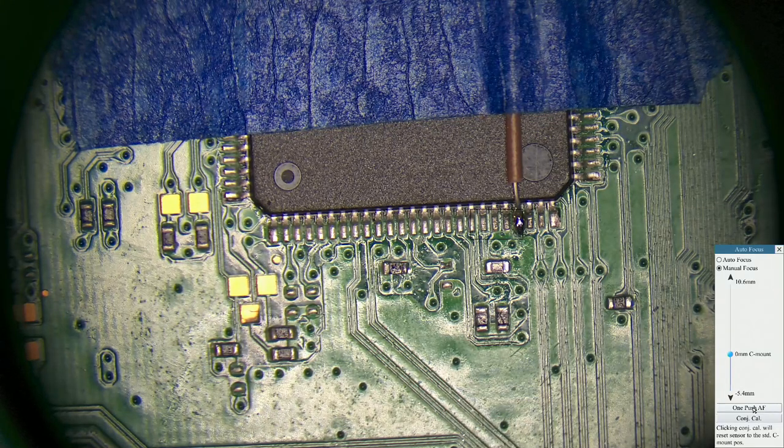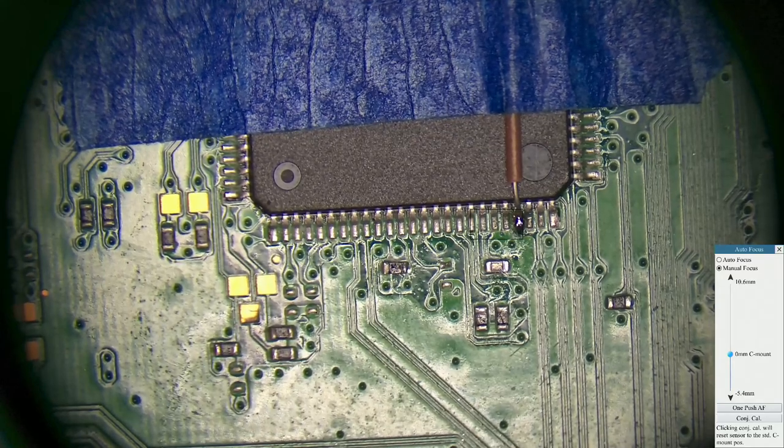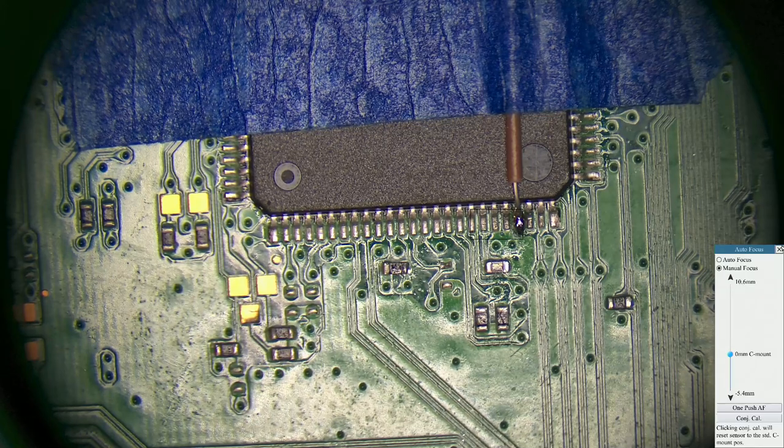Well, okay, so that pin is on and it is well secure. Now the other two leads, if you've seen or read a lot of the Syscon how-tos, they'll show you where the other two pins go. One goes to reset and one goes to the tool pin, which is basically for programming. On the FAT board, that's this board, it's quite simple. It's very easy to do. And all you need is to pick up two points.